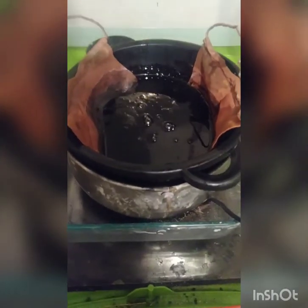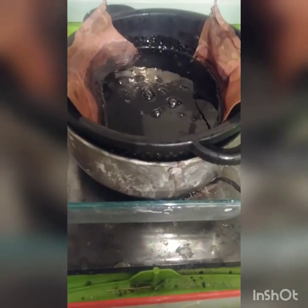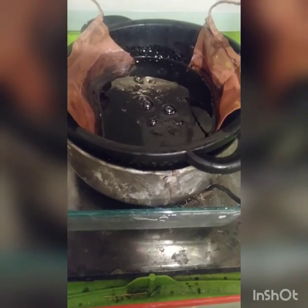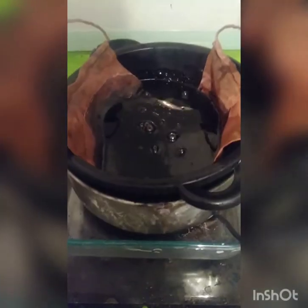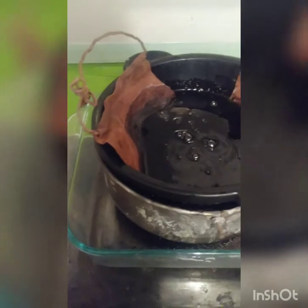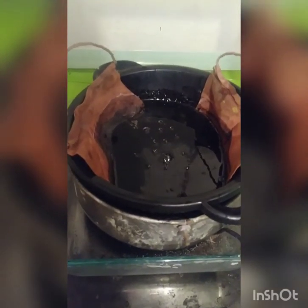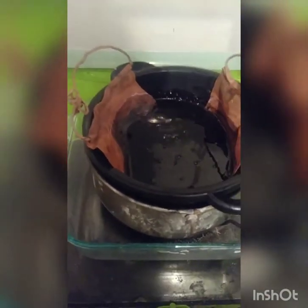After a few pounds and settling overnight, the sludge gets pretty thick. Sometimes I'll stir it with a plastic spoon before starting, just to expose the cathode. I'm not sure if that even does anything, but the sludge seems thick with gold and it disrupts the electron flow, preventing the cell from working properly.